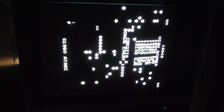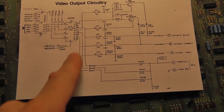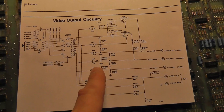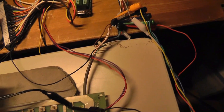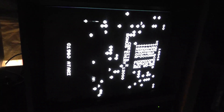If I turn down the contrast here, that looks pretty good. It's playing in black and white, and I do not have any sync hooked up at this point. So pretty much we know at this point that our video signal is actually good through A8. Now we know that the problem is most likely in A9, but I'll put A9 on a scope and look at it. I also have some jumpers here for my red-green so I can do RGB — red, green, blue — and separate sync. But the good thing is the PCB works.